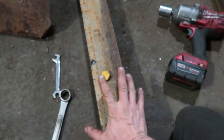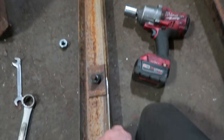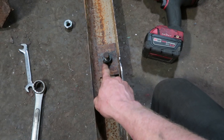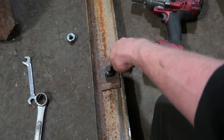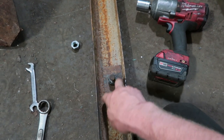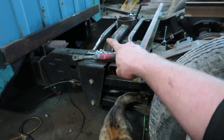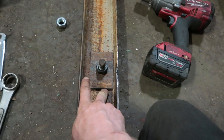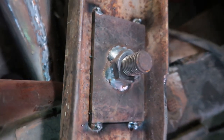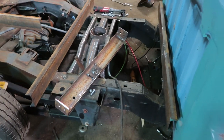I had these bars laid out in place with my plate on top, marked all of the holes, and now I am going to weld the nut and the plate on the back of this. I'm going to weld the nut solid and then tack this plate in place. That way if it cracks loose, or if these ever strip — even though they're grade eight — I can slide this plate out. It's going to be tricky because it's on top, but I've got room to slide them out. So that's why just a quick tack. If it does get loose I could make a cage for around it, but I'll just tack it for now.